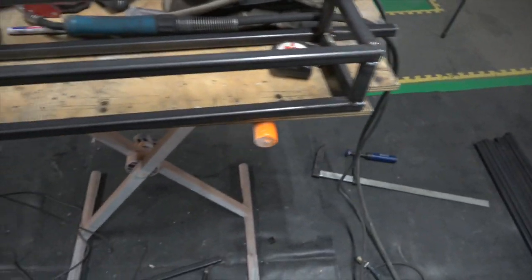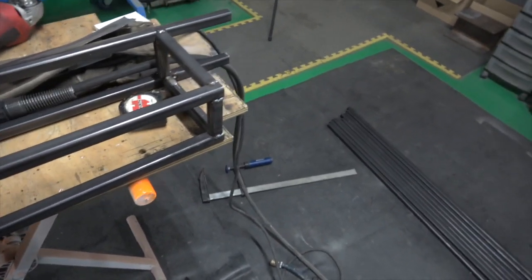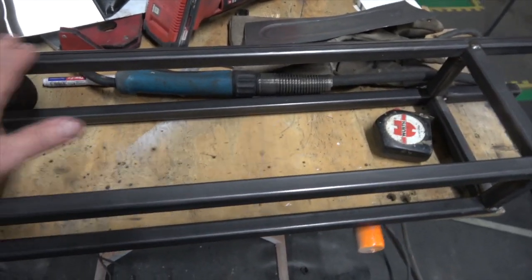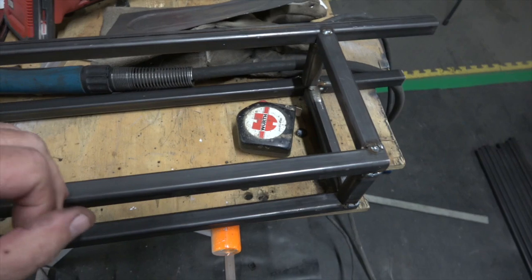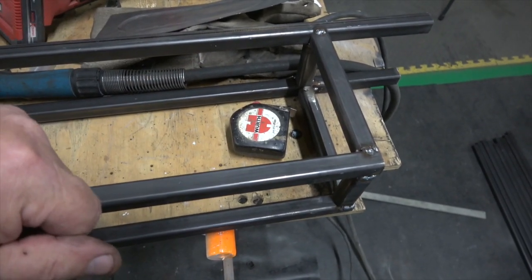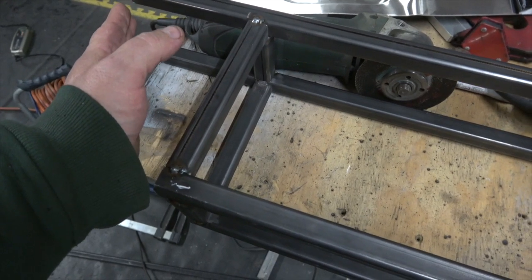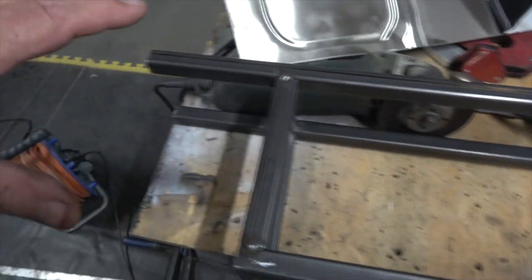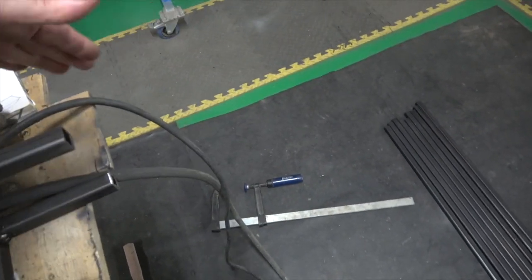This is the basics of the side piece that's going to go on the Moke. I've just quickly tacked it up at the moment because I want to make sure it will work. So this would be where the side panniers are on a Moke, with the 3 ovals in here, or the 3 kind of ovals, I guess they are. And then these need to come up at an angle to make the start of the front mudguard, and then I would bring them up and extend them. So the idea is to make 2 of these with the front wheel and then the rear wheel. Again, this comes up at an angle and then comes up here, and then I can lay the metal on it.